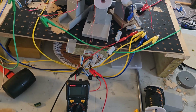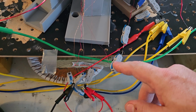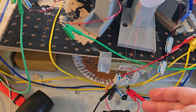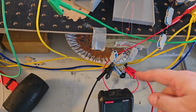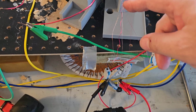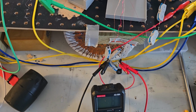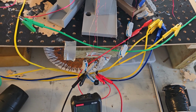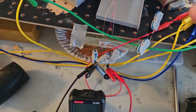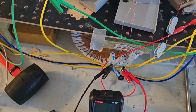and I am running it in a semi-loop, I guess. It starts right here. So let's start at the transistor and the emitter. The power gets sent through and it goes up, follows the diode, it goes up to 26 through the coil, out the 26, through the diode, into the 36, through all the way around, and then into the coil through the 36, or into the transistor. See, so it transfers from the 26 to the 36 right here, and it goes into the transistor at the end of that, and then that's into the collector, and out the emitter again through the circuit.